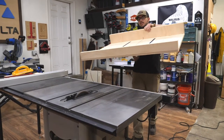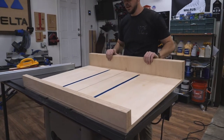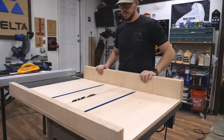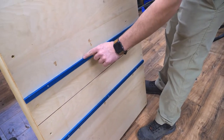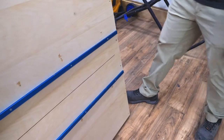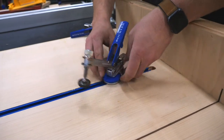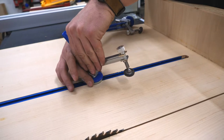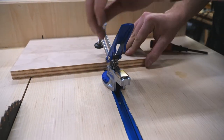The last option is really fun to build — your homemade table saw sled. There are a lot of videos out there on how to hone it in, including the five-point method that many YouTubers have covered. My sled is very simple. I use Rockler miter bars that you can buy and micro adjust with an Allen wrench to make sure they're tight with no wobble or play in the miter slot. I also put T-track on the top end so I can clamp down my pieces, keeping my hands completely away from the table saw blade. You just push the sled through and the pieces stay exactly where you want them.